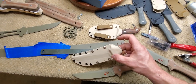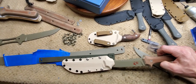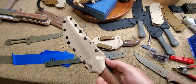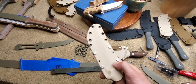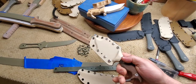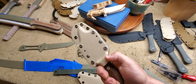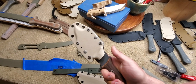Another thing I did differently on this one: I added some material in the hilt zone so I can put the knife in and then push it out with my thumb, since I can't really reach the spacer in there. I don't want the spacer bigger than it needs to be, so there's just a little section you can push to pop it off. On the Tanto, there's nothing there at all because you've got to get your whole hand on it — it's a short grip and you don't want to lose any real estate. But you can reach the spacer on the wakizashi and pull the knife out that way.